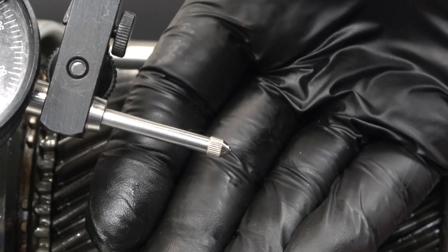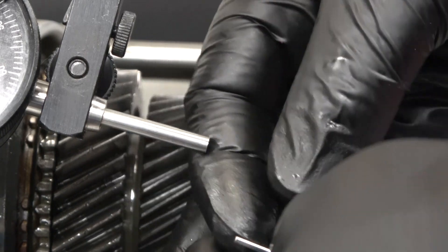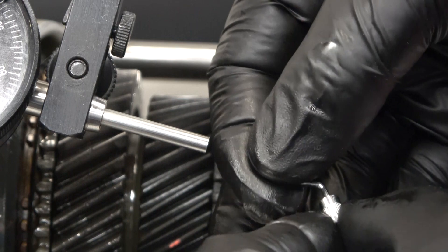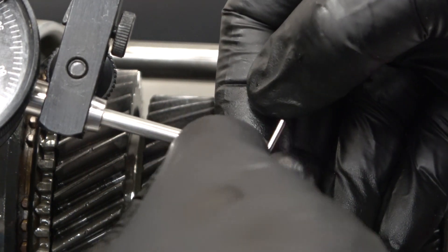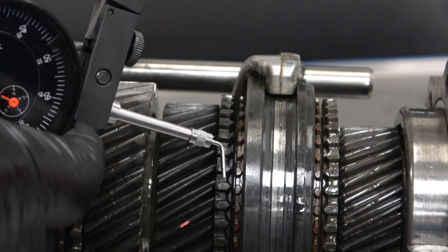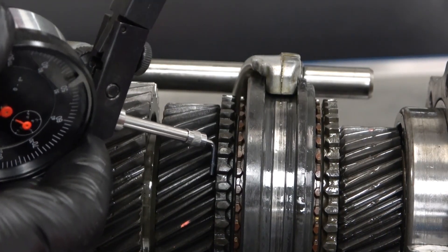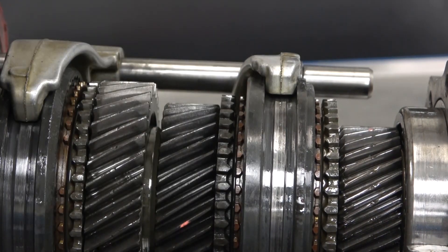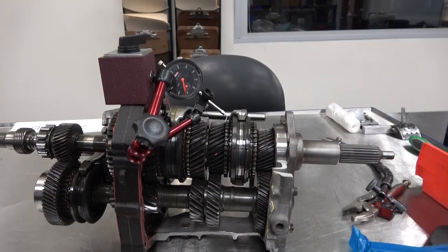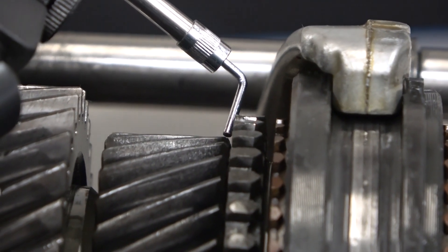One option for a tight-fitting location is to change the tip out and put a different tip that might make the measurement a little bit easier. I'm going to use a little right-angle tip — it's not quite right-angle, it's got a few degrees to it — and we're just going to screw this in and see if we can make that measurement easier by using that right-angle tip. The problem is where it tightens up, because I really want to put that tip in there but it makes it difficult to read the dial indicator, so I need to reposition this. Now we can see that the little adapter can fit in there a little bit easier.